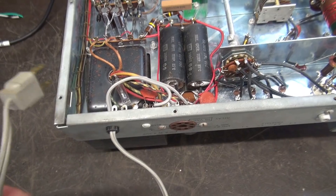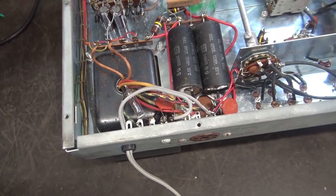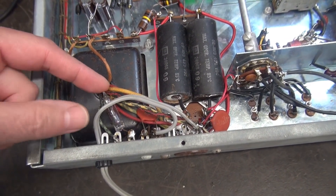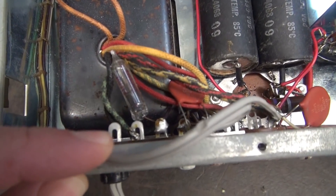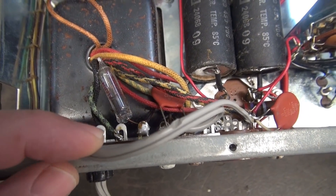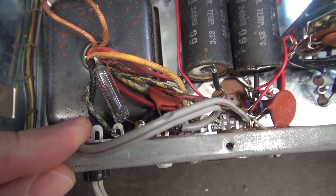Here's the back of the transmitter. There's that two-prong cord from the 1960s. It enters here through the chassis and lands on this terminal strip, and it goes through this little gadget right here. Many of you have probably never seen one of these, but that is actually a circuit breaker. This radio didn't have a fuse — it had one of these old glass resettable thermal circuit breakers.